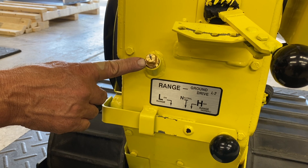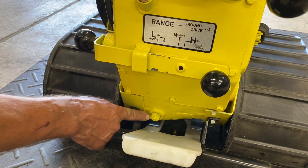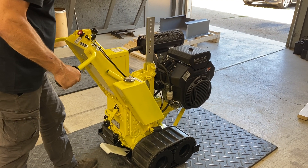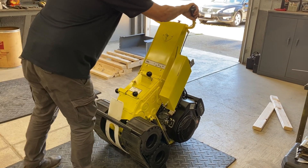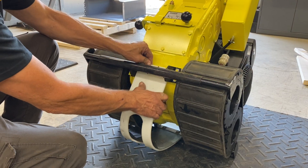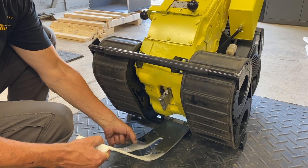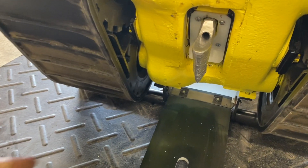There are two plugs located on the back side of the L2. The upper plug is for adding oil and ventilation, while the lower plug indicates the level of the 90-weight gear oil. The L2 is designed to be tipped forward and rearward with the engine turned off. Down below is a ground runner system consisting of the 130W metal and 131 plastic components, which maintain pressure on the turf to help ensure a neat installation.